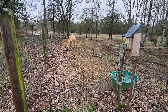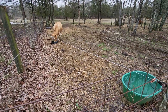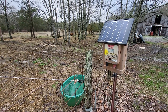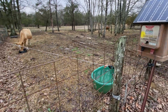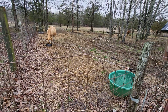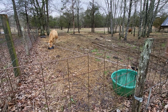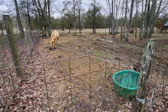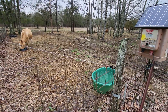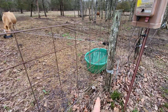In this corner I just set up a single strand of hot wire. I got a solar energizer on it — that's about 25 or 30 feet of hot wire. With it being just that little bit of wire, I know it's putting out at least 8,000 volts. My tester only goes to 8,000, but guessing with that short of a wire it's probably putting out around 12,000 volts.